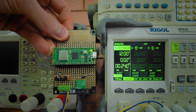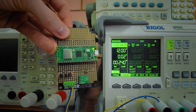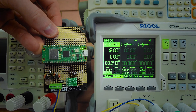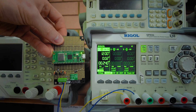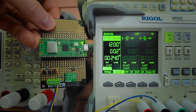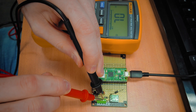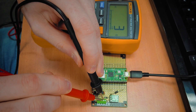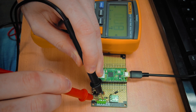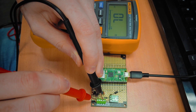Time for a smoke test. I programmed the onboard LED to blink continuously and connected the circuit to a lab supply with current limiting. As I dialed up the current the circuit kicked in, and since the LED continues to flash we know the Pico is running the code and the circuit is sitting happy at about a quarter watt. Next I tested the output circuit — a test script activates each transistor in sequence, and using the continuity function of a multimeter I can probe each channel to see if it gets pulled to ground when it ought to. Importantly there are no shorts between channels either.